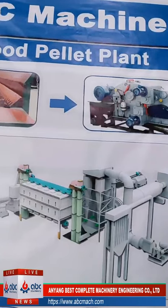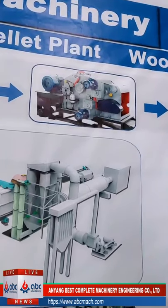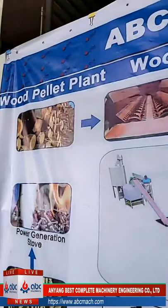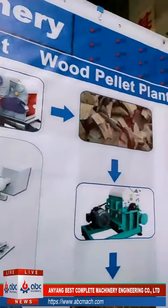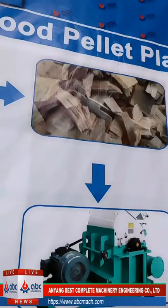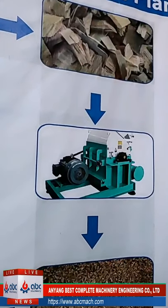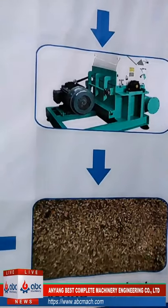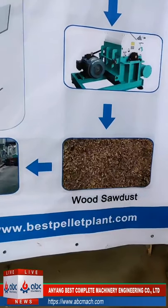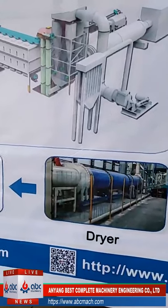After the debarker, we go through here to the wood chipper. The size will change a bit from here, the logs, to here, the chips. The chips are standard chips, and we can make them smaller or bigger. But smaller chips are better for the hammer mill, which grinds the chips into smaller particles, what we call wood sawdust. And the wood sawdust is still wet, so we process it in what we call the rotary dryer.